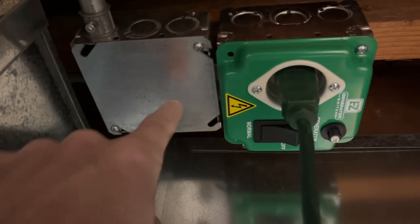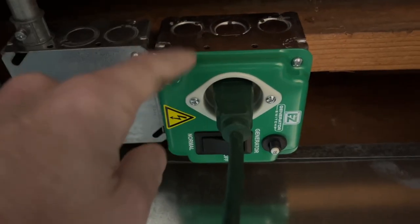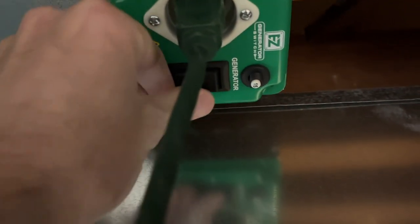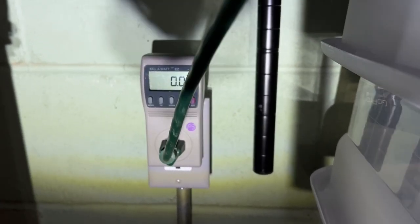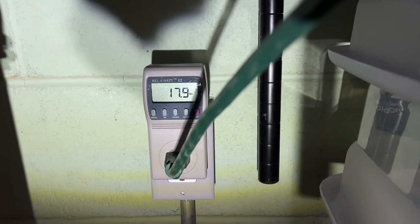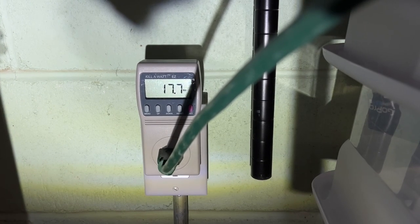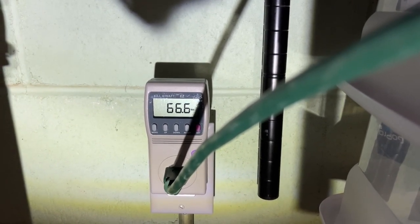The switch is installed on the ceiling here. The wires in this junction box go into here and feed back out, so this is essentially placed in line with the main that's feeding the furnace. I have an extension cord plugged in and we're currently on normal mode. I'll switch that to the middle position — off — so we just shut off the furnace. Now I'm going to switch this over to generator, which is coming from a different outlet in the house. Here's the power meter — we're drawing 17.8 watts. The furnace wasn't calling for heat so I kicked it on, and we're at about 66 watts of power.